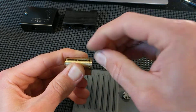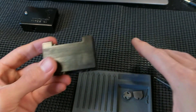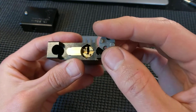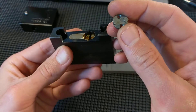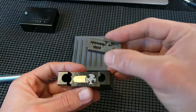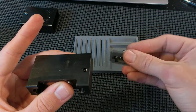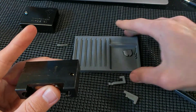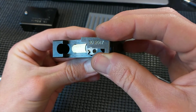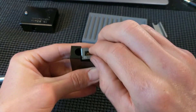It's honestly not too bad. That goes back in the body and the hard part's over. Now we just have to reassemble this. First thing you've got to do is put the tailpiece back on — it has a definite orientation. The square piece goes away from this hole, because it engages with these. Also, if you're really careful when you slide this out of the body during disassembly, you can pull this off in one piece and it's easy to put back on. But if you didn't, the square piece mates with that little notch right there — that's actually what cams everything open. So it has to be in that orientation.